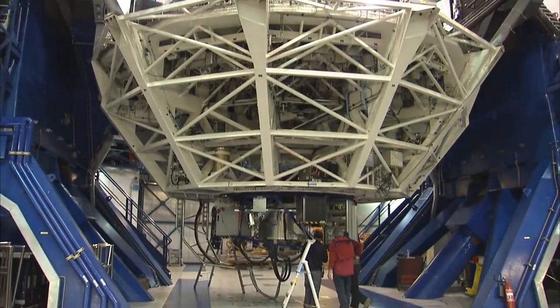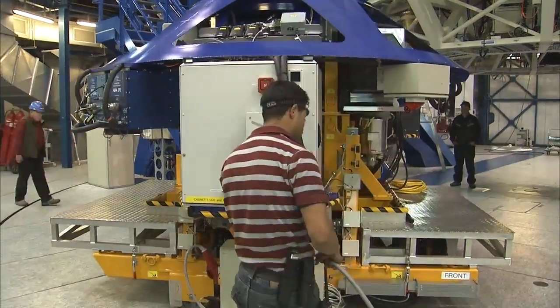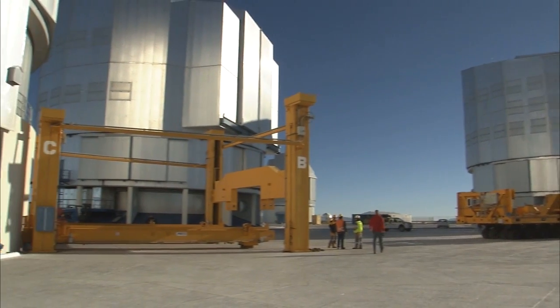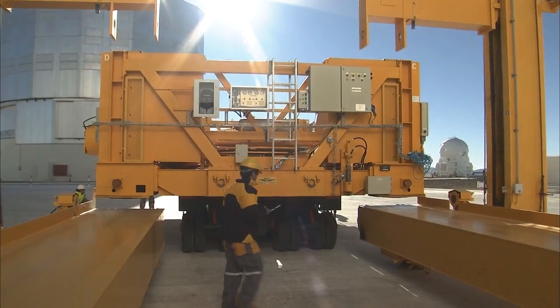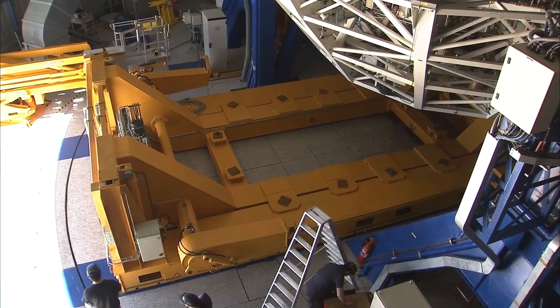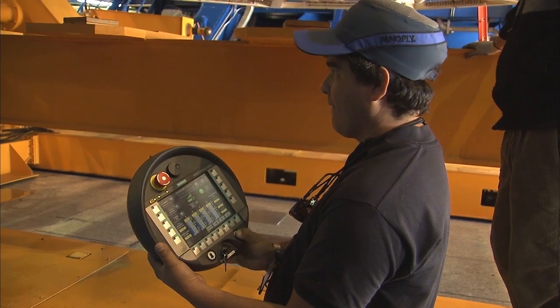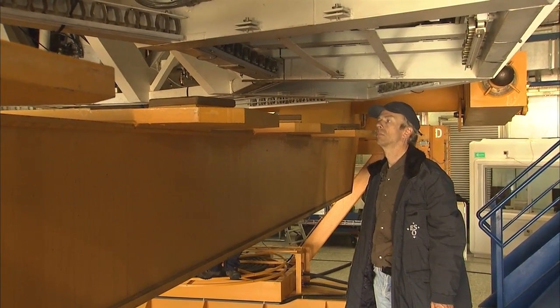The ESO technicians and engineers must work both quickly and carefully to complete this operation on the fragile 17 cm thick mirror in order to limit the telescope's downtime. First, the telescope must be prepared so that the mirror and its cell can be taken out. The team is removing an instrument attached to the mirror cell. Outside, a custom-built carriage is moved into position. This carriage will support the mirror and the cell, cushioning the load during transport. A dedicated platform lifts the carriage to the mirror deck. When it reaches the deck, the carriage slides into the building on a stream of pressurised air, ending up just below the mirror in the cell. The carriage is raised to receive the cell and mirror. Once the cell is safely on the carriage, it can be disconnected from the rest of the telescope. All the bolts are released and the data and control cables are removed. This is always a pretty tense moment, and the team is working very carefully to make sure that they don't damage the fragile mirror. After all, there is no spare at ESO and making a new one would take years.